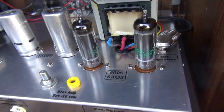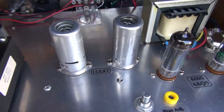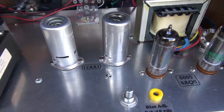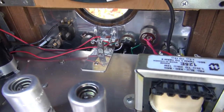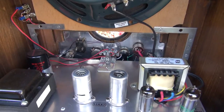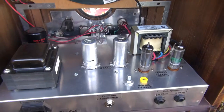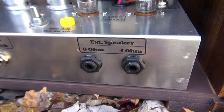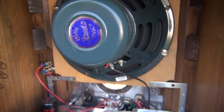These are 6005 output tubes, which are heavy-duty 6AQ5s. We have two 12AX7s — one's the preamp and one's the inverter. And there's a filter cap hiding back there. Controls are on a sub-panel which has to be extended to fit into the cabinet, and there's a lot of bracketing and work that went into making this thing fit properly. On the back, you've got power, your tremolo jack, and your speaker jacks. When you plug in your speakers, they automatically turn off the internal speaker.